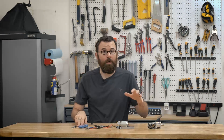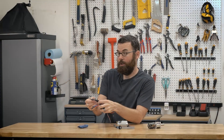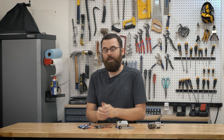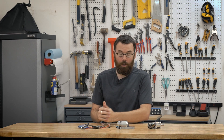Hopefully this video gives you a better idea of what's involved in reflashing a HobbyKing ESC with Simon K firmware. Really, it's not that bad — you just need a compatible ESC, a programmer, a couple pieces of software, and possibly a soldering iron. After filming, I actually went back and redid the soldering, replacing the individual wires with a ribbon cable that plugs directly into the programmer, so I can change settings more on the fly. I plan on tweaking the firmware a bit to see if I can get more out of it. If you're not going to be reloading software frequently, the ribbon cable isn't necessary, but if you do plan on making a lot of tweaks, it's a big time saver. Overall, I'm very happy with how the brushless drive has been performing, and there'll be more tests in the future. This process is now done, so I can start working on the robot itself.